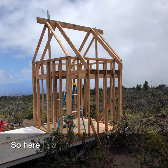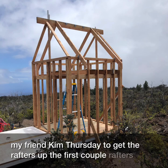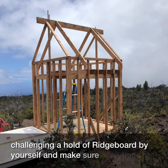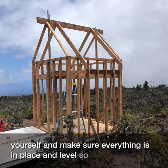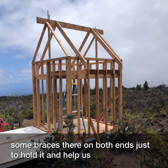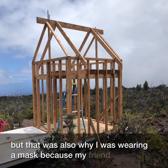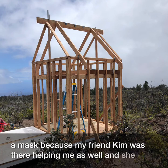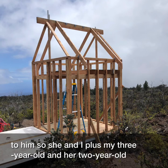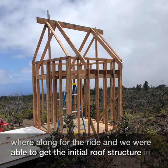Here I did have some help from my friend Kim to get the first couple of rafters and that ridge board up. It's definitely challenging to hold a ridge board by yourself and make sure everything is in place and level. I created some braces on both ends just to hold it and help us get it in place. Kim, my three-year-old, and her two-year-old were all along for the ride, and we were able to get the initial roof structure in place.